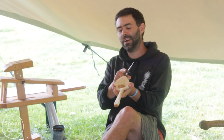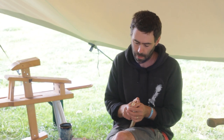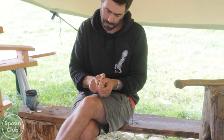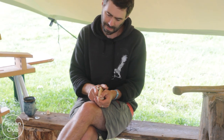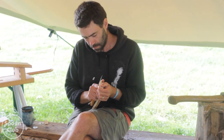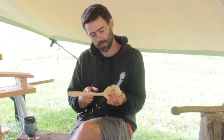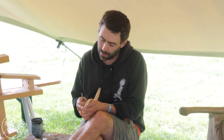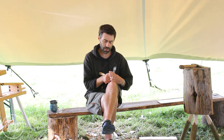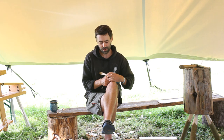I've got this kind of tip for scraping - I quite like that to be the highest point on the bowl, it just looks nice. As I've taken that down, I've got to take this side down a bit too, because of what I was saying about the sweep of the top. I always want the lowest point on the top to match up with the lowest point on the bottom.